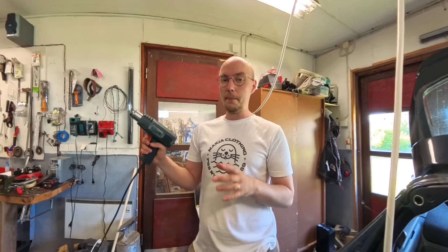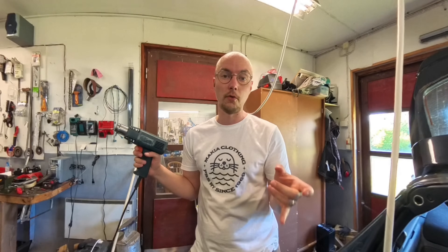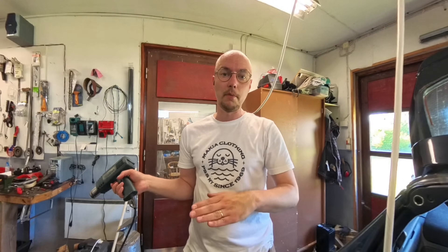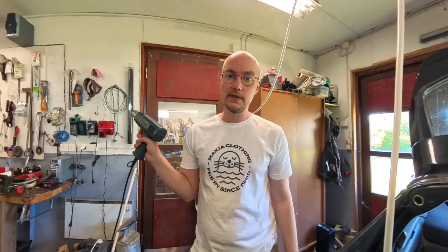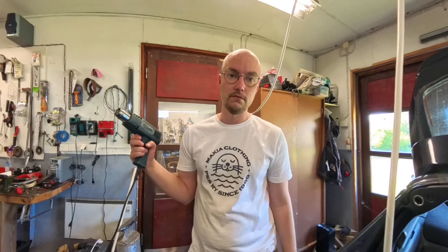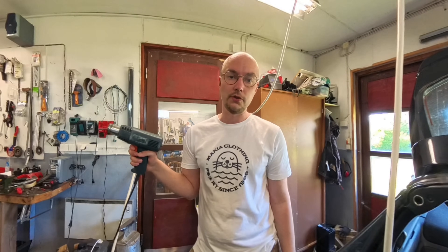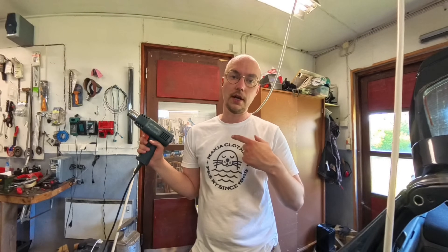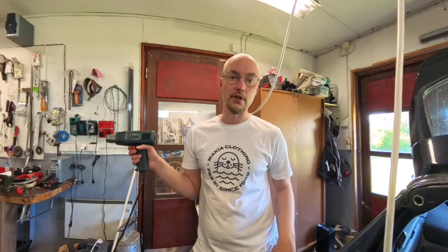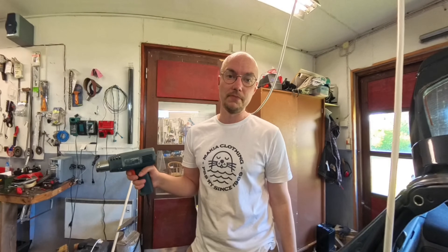We are really close. The house is not consuming a lot of power and I want to connect them both when there's no load on the system. You might know that when you put load on a system the voltage sags, and when you remove load it shoots straight back up. So I'm using this 3-kilowatt hot air blower to try to speed up this process, and then when I release the trigger I'll check that the unloaded voltage is around where it should be.